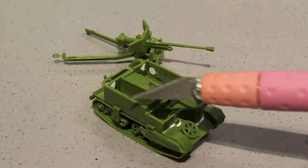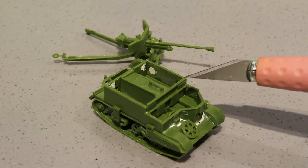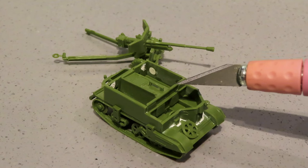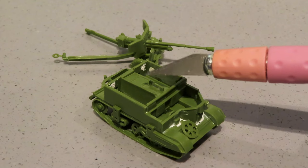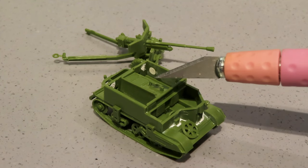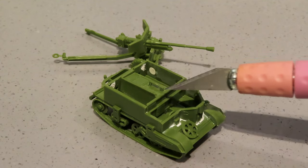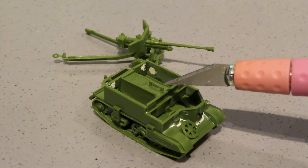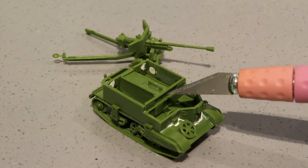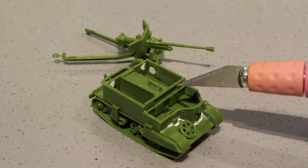So I fitted all the perimeter of that and I fitted this cross piece. The reason I suggest you do that first and let all the glue dry is that then you can fit this middle piece and fettle it so it fits in between these two points. If you don't, what tends to happen is it pushes things further forward, and then you have an issue that it doesn't look right.